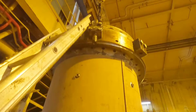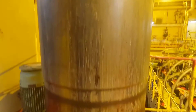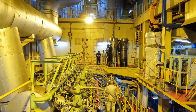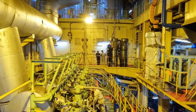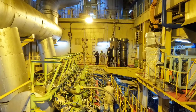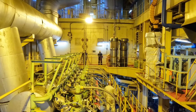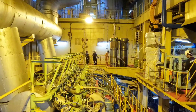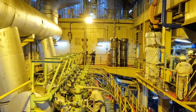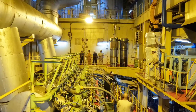On that side you can see they are making the spare liner ready. There are a few materials you have to place on it before inserting it into the main engine, like quills and insulation seats. All these things you have to make sure are placed before inserting the liner into the main engine.